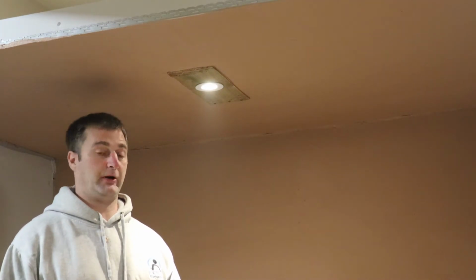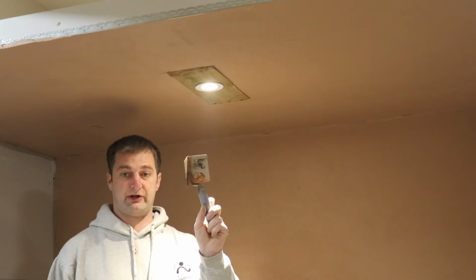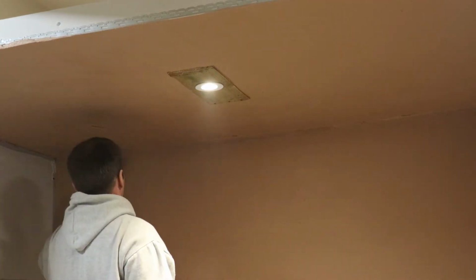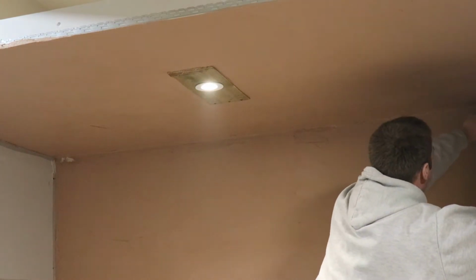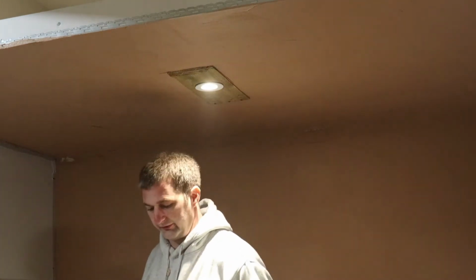About 10 to 15 minutes since I put this ceiling on that part of the wall. So what we're going to do now is get it flattened. First of all, I've got my internal angle trowel, which I call a twitcher. I'm just going to run that into the angle all the way down, just on the wet internal angle. I'll do it end to end, and all that does is remove all the excess plaster that's stuck in there.